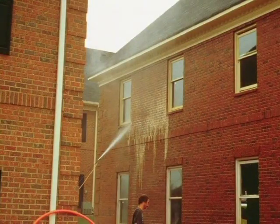You just about can't put too much water on the face of a brick job before you start cleaning. Thoroughly saturate it. Pass over it several times with a hose. That's one problem I have with pressure washing. Usually you don't get it wet enough before you start. But if properly done, it can be a good way of cleaning brickwork, obviously.